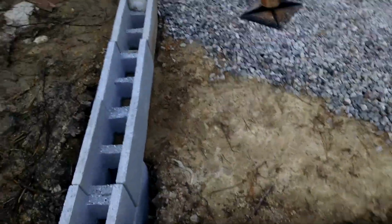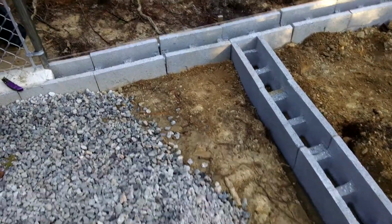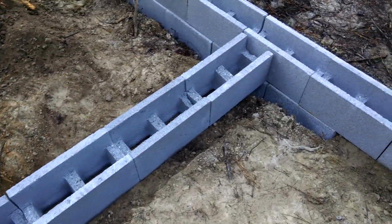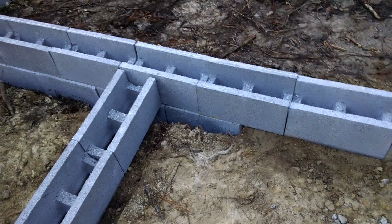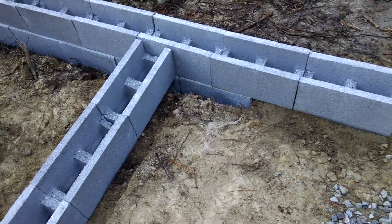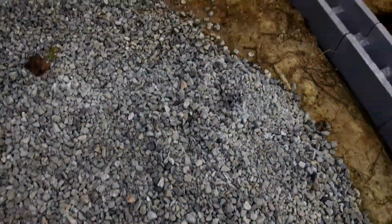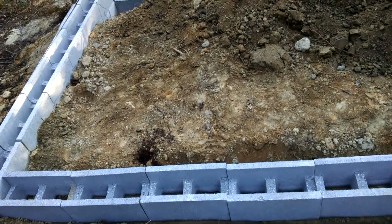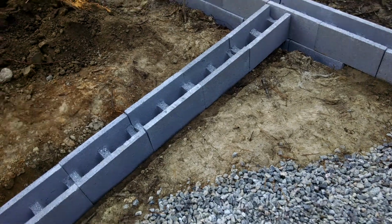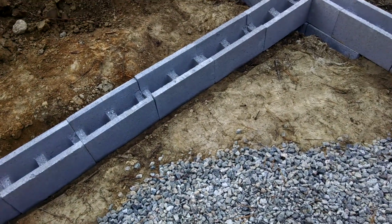and I got to do the same thing over here. Just take some of this backfill, and see, I filled that little void over there, and I got to fill some of this here, because otherwise that'll just eat my gravel up. That'll eat my stone up. And down there in that corner, there's backfill. I still got a little pile of stone here that I'm standing on, but because it's high, I don't think I got enough just yet. And I may not even bother with the bucket, because I got to spread this out once I backfill and see where I'm at.